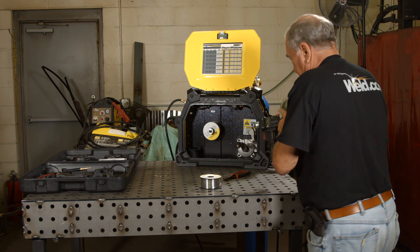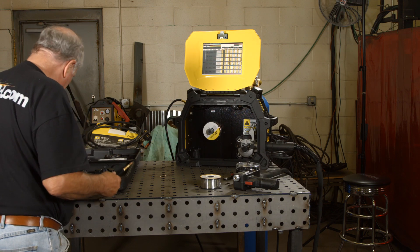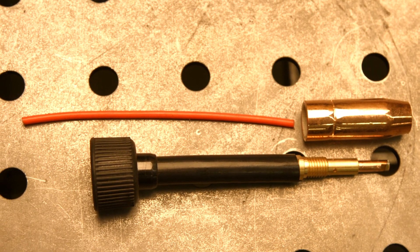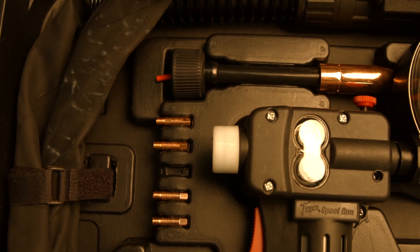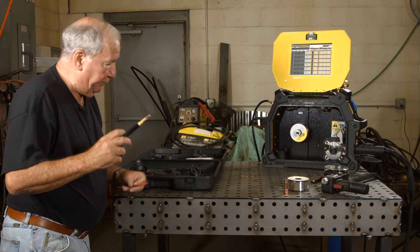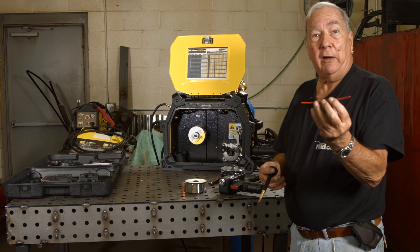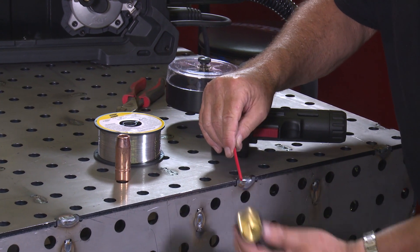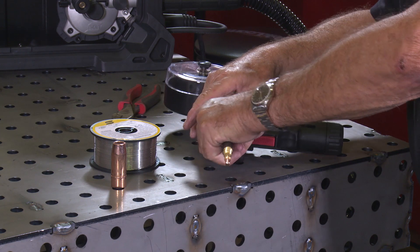With the spool gun comes the nozzle — you'll see this little orange piece of plastic and a nozzle. It already has a contact tip in it, but there are spare contact tips in a variety of sizes for different sizes of wire that you might run. There's also a spare gas nozzle and a spare diffuser. This is basically the Teflon liner that sometimes you have to use in a regular MIG welding gun if you're going to be feeding aluminum. Let's just stick that in there — the rest of it runs down inside this hole — and screw this on. Simple as that.